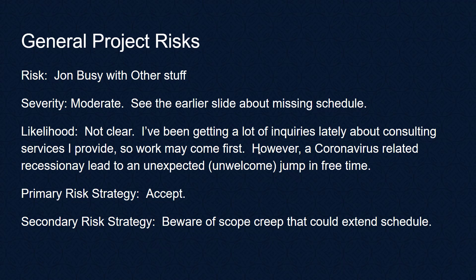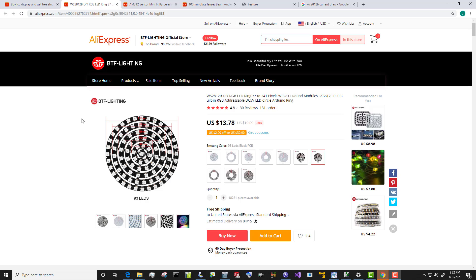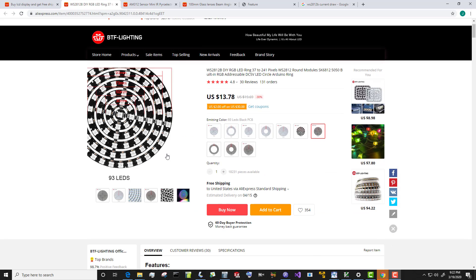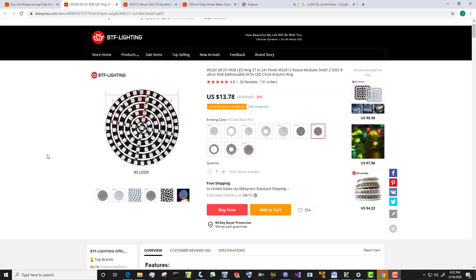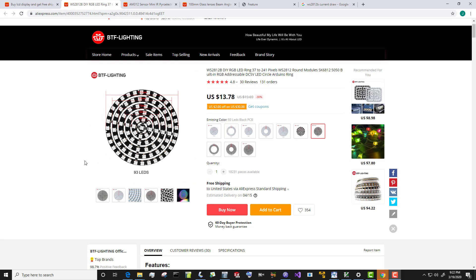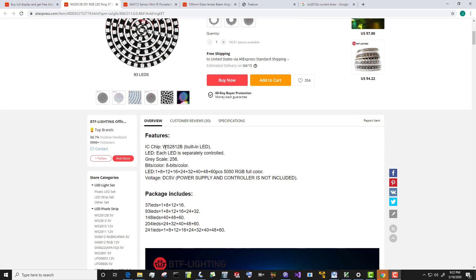Next, let's take a look at some potential parts. Feasibility is related to our ability to get parts we like, so we need to get critical parts moving quickly. Looking at possible parts on AliExpress, I came across a combination of 93 LEDs in a circular package that's 110 millimeters wide. I was picturing around 4 inches for the lens diameter based on the size of the chest. These use the WS2812B — a serially connected RGB LED — which should work very well for our purposes.